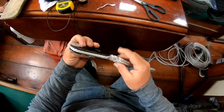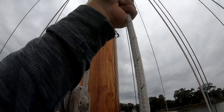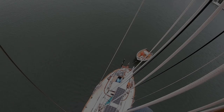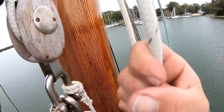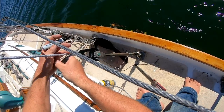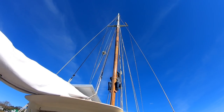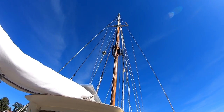Looks like we actually got this measured right - you can see my original markings. So we've got to go up and hang this thing on the mast. Each new shroud will require three trips up the mast: the first trip to simply hang it with one end spliced and then measure at deck level so I know where to put the other splice in; the second trip to remove it and bring the whole thing down below to splice the other end; and the third trip to actually install the new shroud.